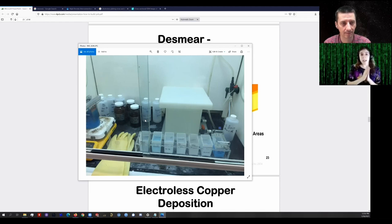There are tin ions in solution — a relatively dilute solution. These are Sn2+, usually in the form of tin chloride, SnCl2. The tin is electrostatically attracted to these dangling bonds on the epoxy and will just kind of stay there, conformally coating the surfaces inside the holes — spread out, not shoulder to shoulder, but that's okay. You can't see anything at this step. The tin solution is clear, and the tin ions produce no color change. So the board looks exactly like it did at the beginning — maybe the copper looks a little more peachy from the micro-etch, but other than that, no color change. We then rinse it again.